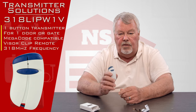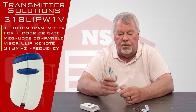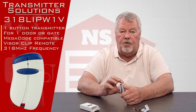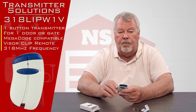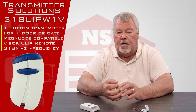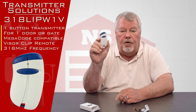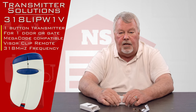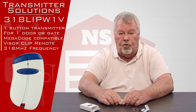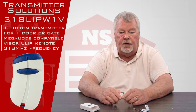That means the radio receiver that this is going to talk to has to have that serial number from this remote programmed into it. We typically see these type of transmitters used in higher security situations — it's uncommon that you'd have this on a garage door at home. It would be more applicable in a gated community, an apartment complex, or a condo association. You can't tune this in yourself; you'll have to take it to the management office and they'll record the serial number so they can tell the radio receiver to start accepting signals from it.